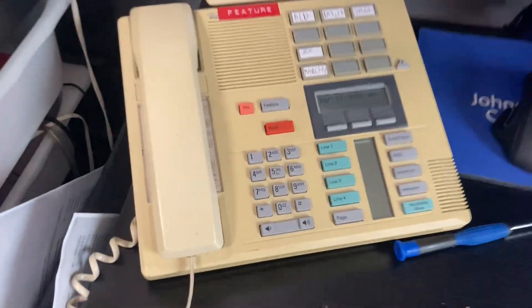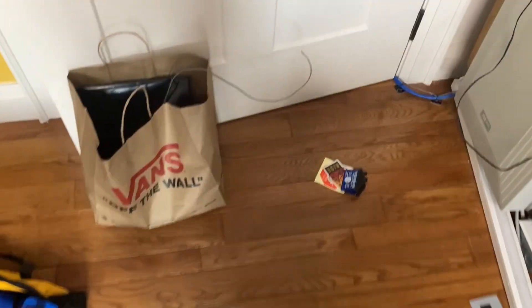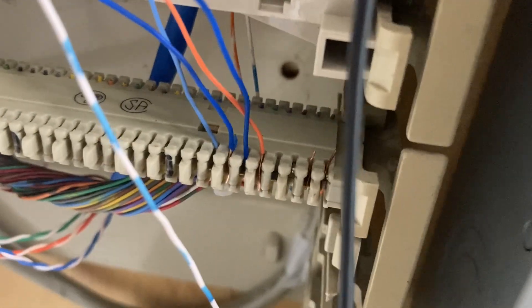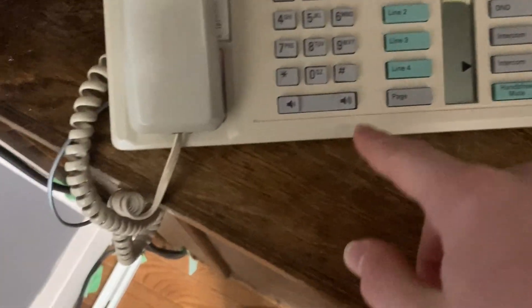Okay, so it's now functional. I thought I was going to have to wire a relay in to the paging relay, but no — it has a relay built into it. I wired it in right there, and now I've fixed the volume issue. It still sounds a bit tinny — I'm not sure why — but progress.